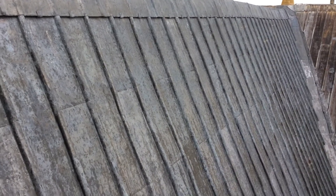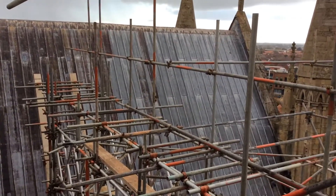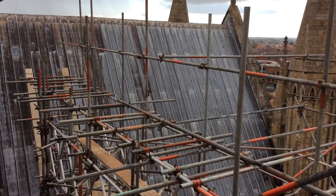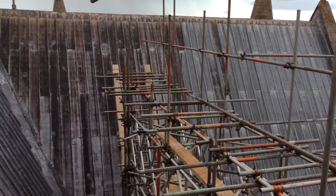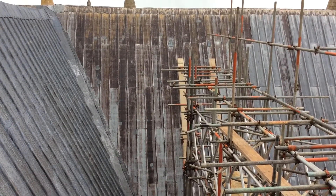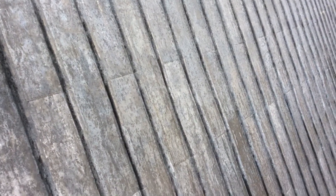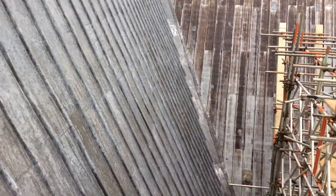As you can see, the new, the old, and the partly new — that would have been re-laid at least in the last hundred years. Can you see the difference as we come round? All that brown that you can see is metal oxide, because it hasn't been cleared off the top of the molten lead, poured and struck the sheets out on this casting bench. But here it has. Should stand the test of time — should last at least 200 years.